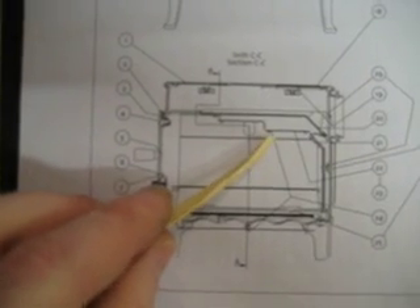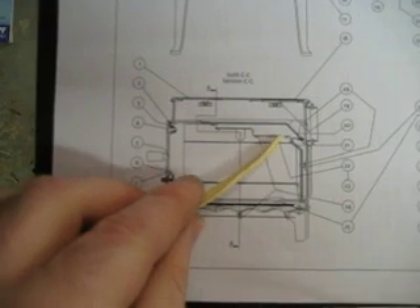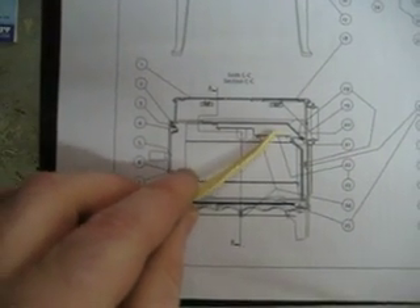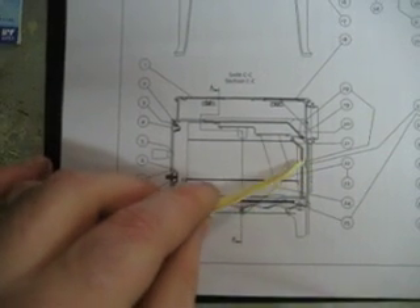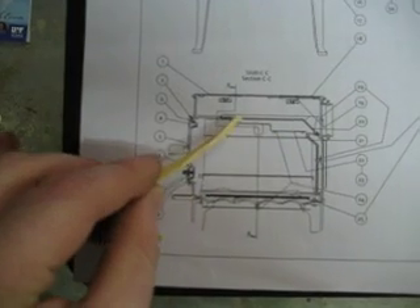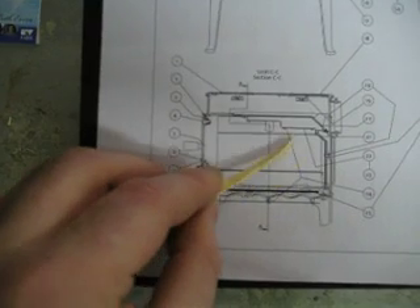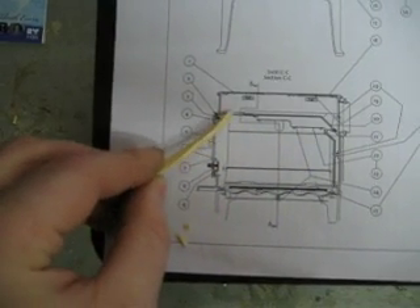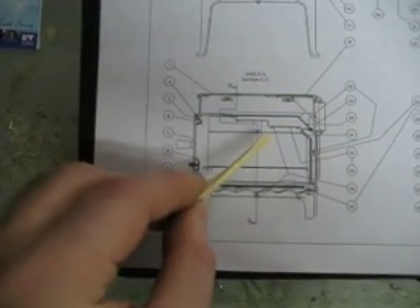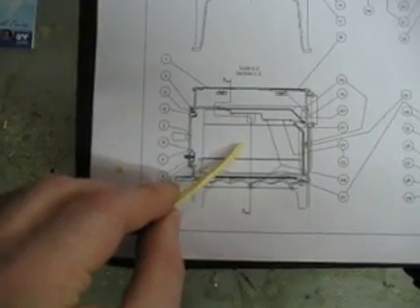On the inside, I'm going to show you this. If I can get zoomed in right here — this portion here is an air chamber that brings in secondary air from the back of the stove. So it actually travels up, moves through this chamber and into here, and then there's a set of holes here. When your fire logs are in here and the fire is burning, licking up across here, it comes through this chamber, back up the top, and then out the flue. And what that does is helps burn off any unburned gas, and it just gives you a lot more efficient burn.